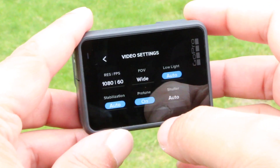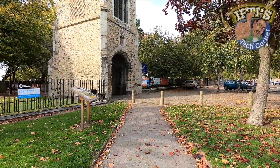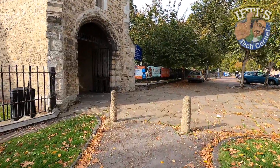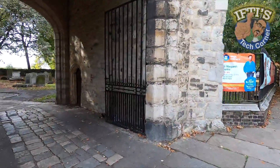For those that aren't familiar with how digital image stabilisation works, it crops in on the image a set amount so it has room within the frame to move left, right, up, down and roll so that it can attempt to match the scene in every frame using accelerometer and gyro data.